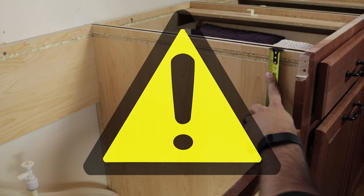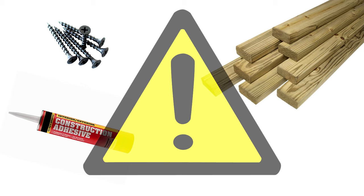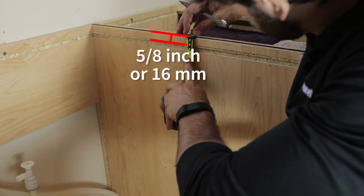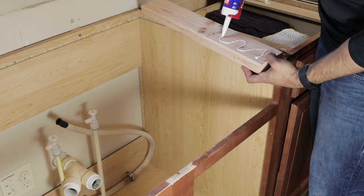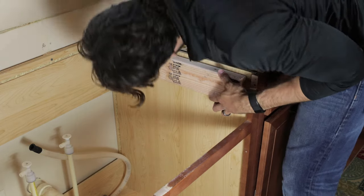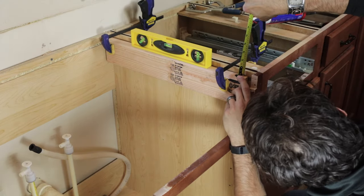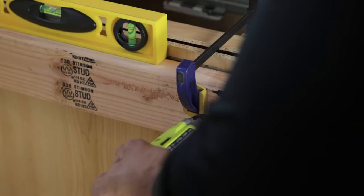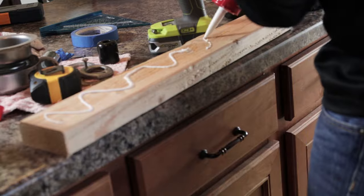For proper countertop installation, the top of the sink must not extend above the top of the cabinet. The top surface of the sink should sit approximately 1/16 of an inch or 2 millimeters below the top edge of the cabinet. Also, be sure to use appropriate fasteners and material for your support framing that will support up to 300 pounds or 136 kilograms. Measure 5/8 of an inch or 16 millimeters from the top of the cabinet and mark. With a level, draw a line across the cabinet with your marks. Measure the length of the cabinet, then mark and cut your top rail support board. Apply construction adhesive to the board and attach to the cabinet, lining the top of the board with your mark. Ensure the board is level and use clamps to hold the support in position. Double check that your alignment and measurements are correct. Ensure the screws are long enough to secure the support framing but short enough not to extend through the walls of the adjacent cabinets. Secure the support with screws and repeat this process for the other side. Then measure and cut two vertical supports on each side, apply adhesive to your support board, and secure with screws.